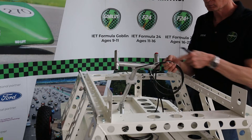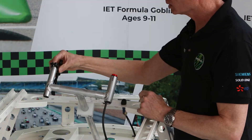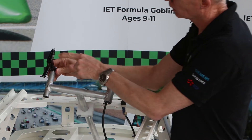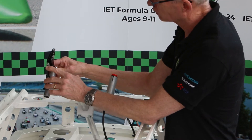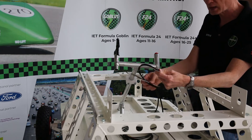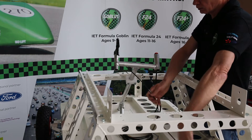So now I've got to get our brake cable and our brake lever. The first job is to get the brake lever mounted on the handlebar on the left hand side. I'm going to rotate it around to show you this side of the brake lever and the end we're going to connect — the barrel connector here. The other end of the brake cable is a loose plain piece of wire. Be careful when unwrapping this because it's very springy and it could fly off and catch your eye.